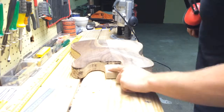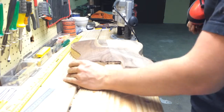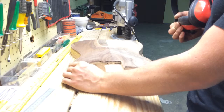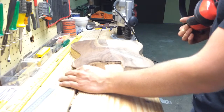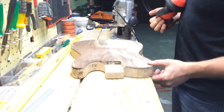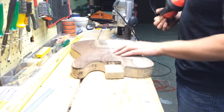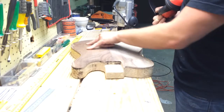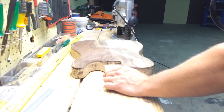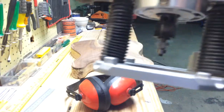We're at the point now where I've cleaned up a little bit in the pocket and around the horn edges. I'm going to hit that more when we get to the finishing stage right before we go to stain and poly, but we can round over the edges right now. We're going to do it on both sides, and once we get that done, the next step is routing out the electronic cavities. It's really going to start to look a lot sharper just with rounding over the corners.